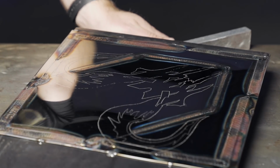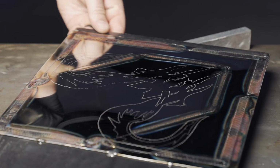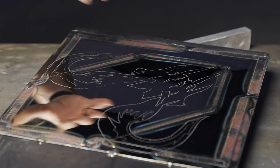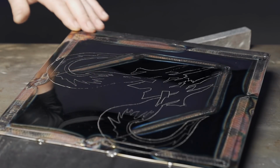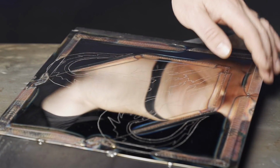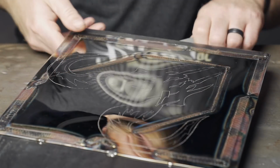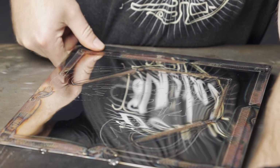Second thing is I'm definitely gonna need a thicker heat sink or backing plate next time, and one that is wide enough to be able to be tacked and welded, stitch welded all the way around, because I have been constantly breaking these tacks and having to go back and re-weld them. The reason I didn't want to do it too much is because I wasn't really planning on putting a border around this, and I want to be able to clean these up and not have them be noticed. But now we're going to start in on the main part of the skull and horns.